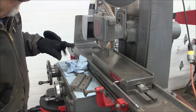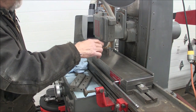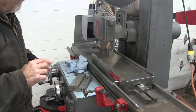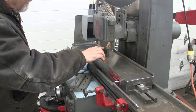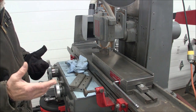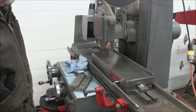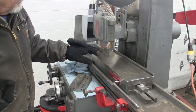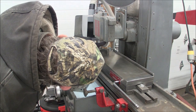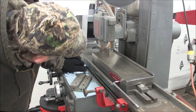and that should be dressed. Now, how do I know that I've got the whole bottom of the wheel dressed? Because let's face it, when you use this thing, it breaks down on one side or both sides, depending on the direction that you're feeding. What I do is I listen to it, and when I hear sound all the way to the edge of the wheel, then I know I've got across the wheel. Another way to check is by looking at the bottom of the wheel, and you can see at what point the wheel is broken down from your last grinding pass. If it's clean all the way across, I know I've got it dressed